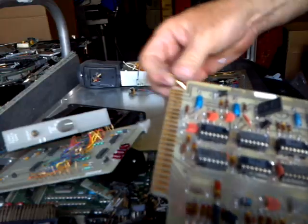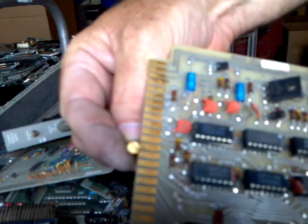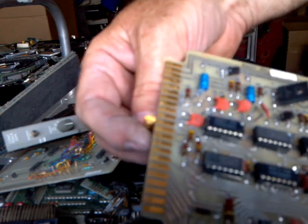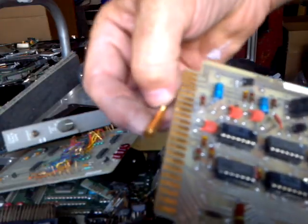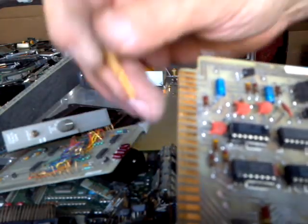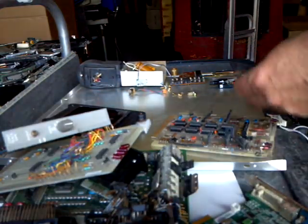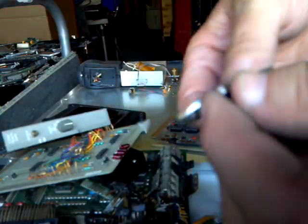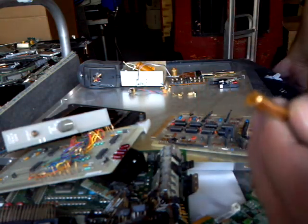I did find a couple of connectors that really fooled me — it's just about as close to the exact same color as you can get. I would have said that's got to be gold, except my logic kicked in and I said, hey, that's a screw head — that's probably not gold. It's probably just brass, and if you look at the whole thing, you know that's not going to be gold-plated. There's just no reason for it to be — it's a screw. Screws don't need to be gold-plated. Gold-plating needs an electrical connection, so that's one of the big key pieces. One way I confirmed this: it attaches to a magnet like most screws, and so it's just painted or plated in some fashion, but certainly not pure brass either.